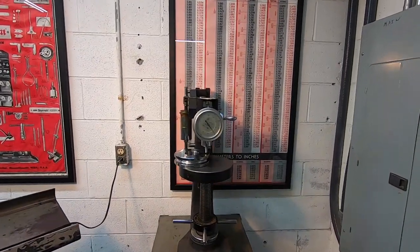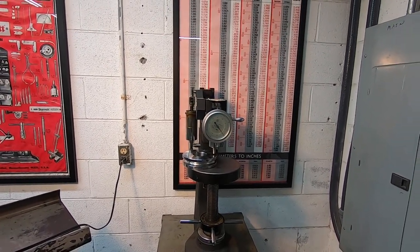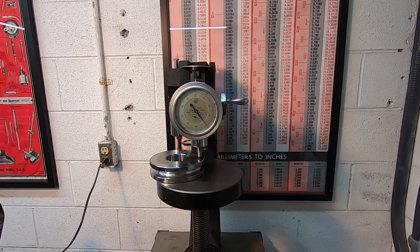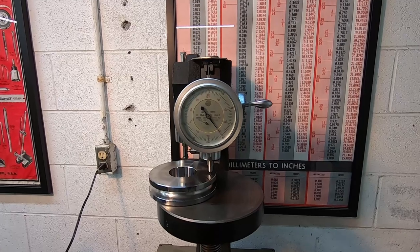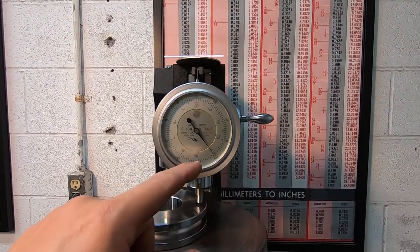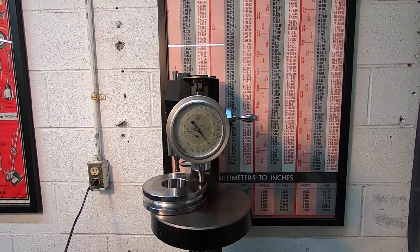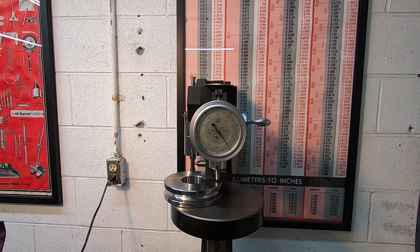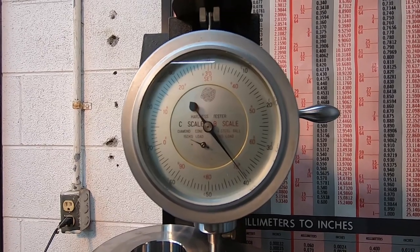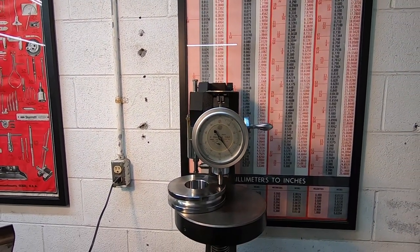I was real curious and wanted to go ahead and check the hardness over here on this hardness tester as well. This is the second one where I said that I was at approximately 40 to 41 Rockwell. And this one confirms that I was very close. So on this scale, it's showing 39 and a half. So you've got to give yourself, I think, a couple of points on doing these tests like I'm doing here. So that's putting me right in range of where I tested over there using the PTC hardness tester.